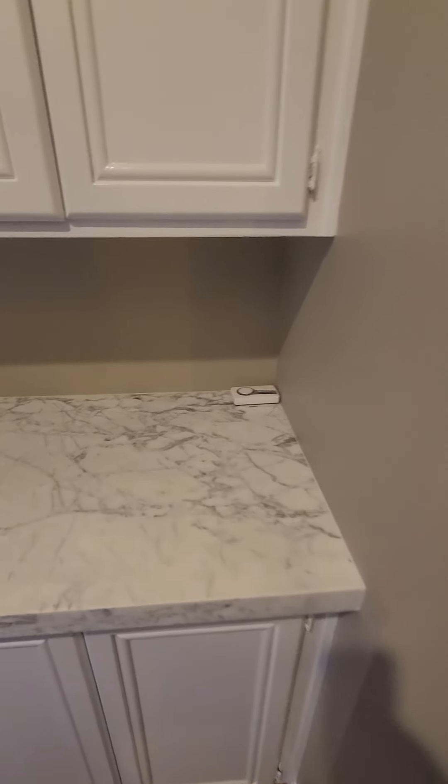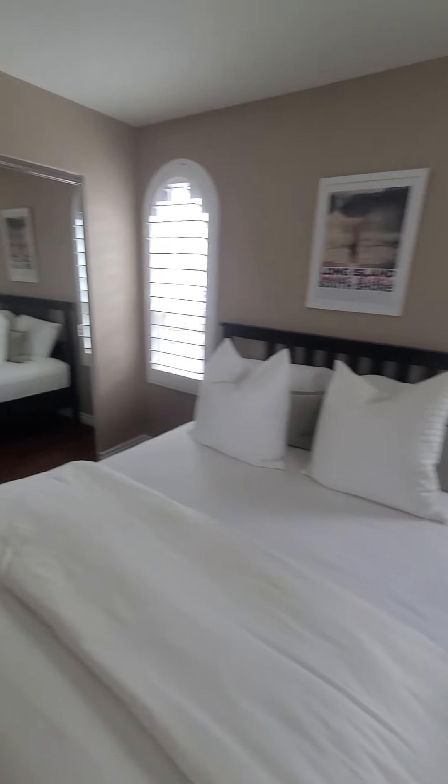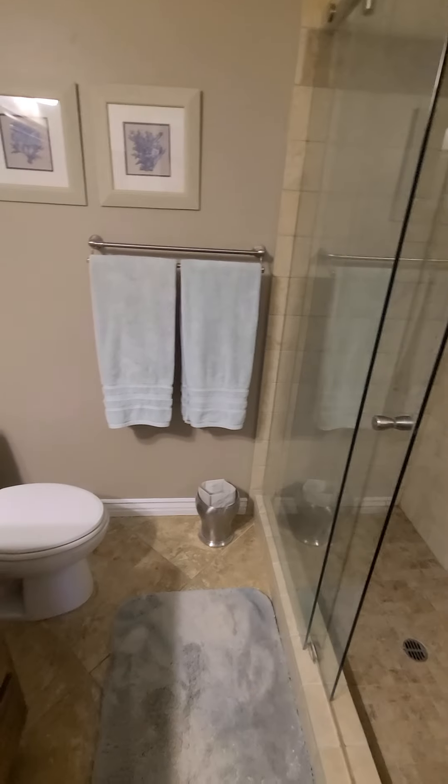The carbon monoxide alarm at the top of the stairs needs to be secured to the wall. The front bedroom windows are in good shape and closet doors are in good shape with no cracks in the mirrors. Smoke alarms are on all bedroom ceilings. The hallway bathroom is in good shape — exhaust fan is working, toilet is secure, no leaks under the sink.